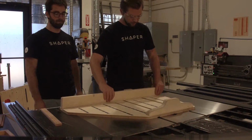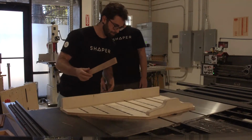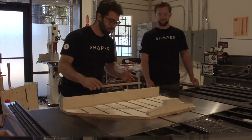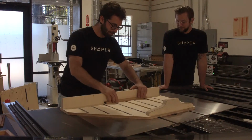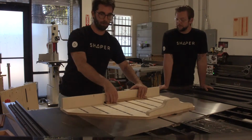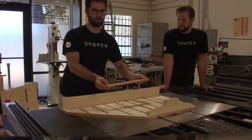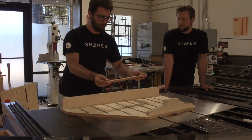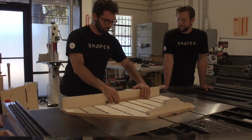Nice. Let's just show this with the material in here. Just in case nobody's seen a crosscut sled before, you would put this in here or here, probably this way, and that allows you to feed it across with that good reference face, as opposed to trying to use this tiny face on the fence, which is a terrible, terrible idea. This way on the fence, this way on our nice crosscut sled.